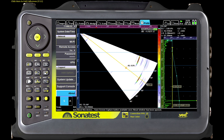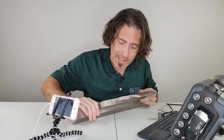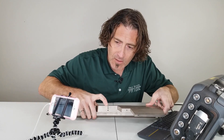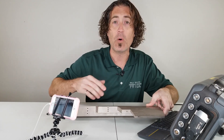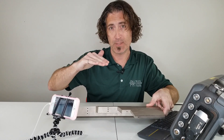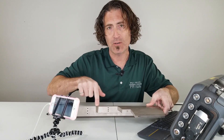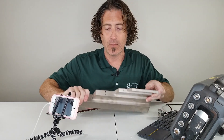This is just a 16 element, 5 MHz probe — nothing crazy — and I've got three clean legs. One of the questions that comes up about these blocks is: why does it look like the holes aren't in the right spot? If you look at the end of this sector, the holes appear a little bit too high, and that's simply because the holes are drilled so that they cross exactly through the 25, 50, and 75 percent — or quarter-T, half-T, three-quarter-T — positions when they are at the center of the sector. So they start out high on the outside and by the time they get through the middle, they're in the right spot.